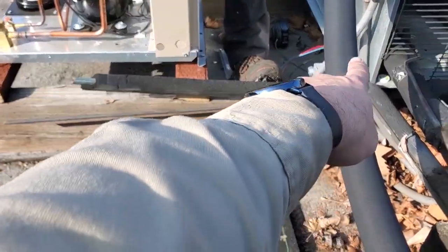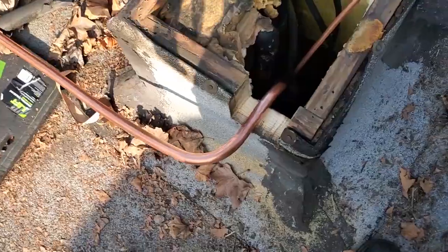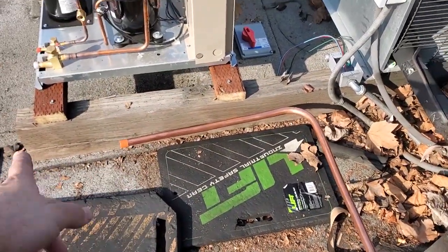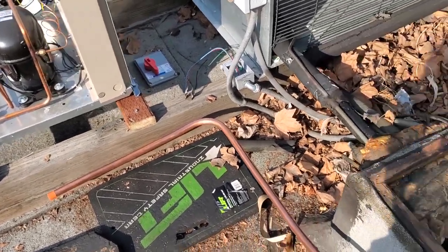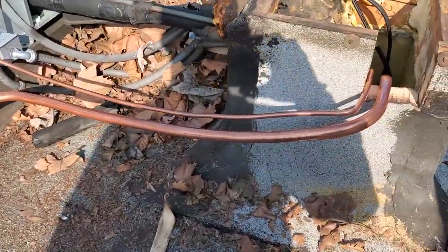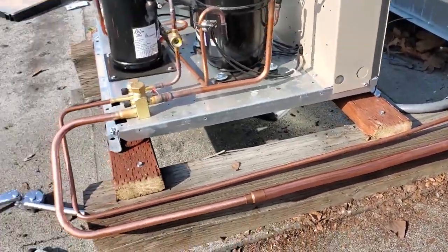We're working on moving it over here. It is not going to be perfect — this is a retrofit job, so it's not going to look like a new install, but we're going to do our best. We got our line bent and we've got to make a connection right here. We'll slide the insulation on and strap it to that two-by-eight. We're going to do the three-eighths now and bend that out. We are pretty much ready to braze. We've got everything bent and yes, it looks a little funky, but once we insulate it, it'll all clean up and come together. This is soft copper, so it's very pliable.